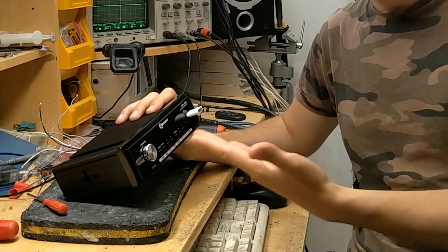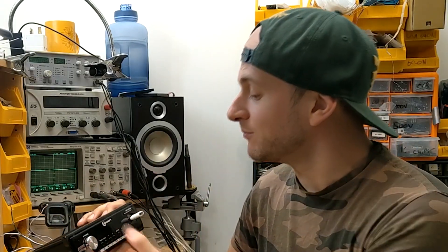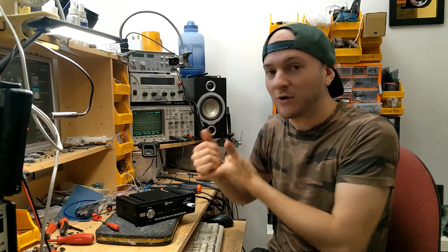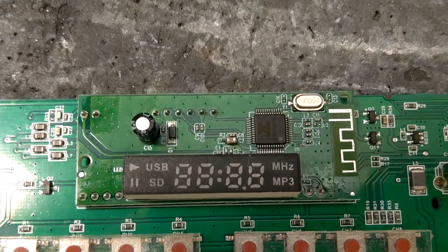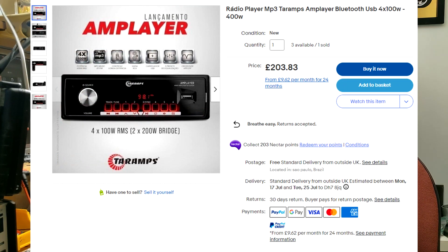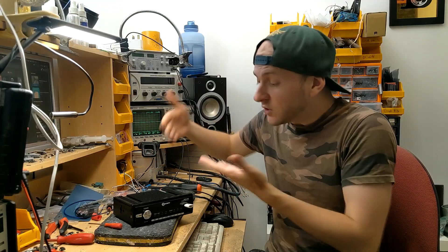This thing has potential. It's got a decent amplifier IC chip, but it gets let down drastically by the audio processing. Taramps haven't made the audio processor, Bluetooth receiver, or amplifier chip themselves - they've just put together the supporting circuitry like power supply, filter network, and pre-amplifier. To fix this, all Taramps needs to do is select a better audio interface and processing unit for the front plate. Bear in mind that Taramps actually sell the amplifier stage separately as the 400x4 for less than half the price of this head unit. You could pair that amplifier with a cheap thin head unit with better audio processing - even basic bass and treble adjustment would be better - and get a much better experience for a similar price. So honestly, I don't recommend this in its current state.